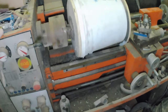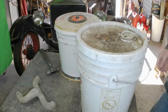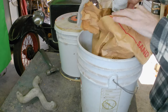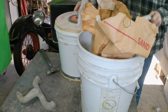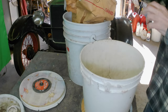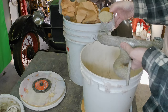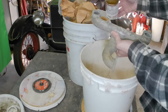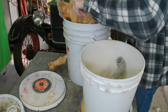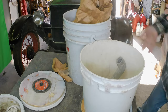Here I'm testing the bucket — it's empty — just testing my theory, proof of concept and all. I got my sand out. I thought it was Black Beauty, but it wasn't — it's just playground sand. I think that's probably best for this because aluminum is a soft metal, and I've never done this before. We are going to put the part in the bucket, put the sand in the bucket. I'm aiming for about half a bucket because I want the sand to be able to move around.